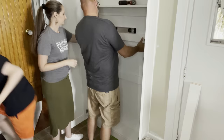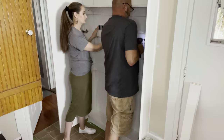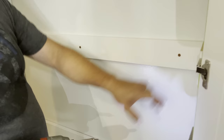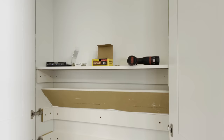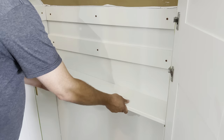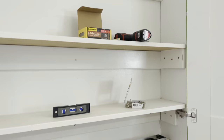What I love about this project the most is that we were able to install shelves where we wanted them and however many we wanted. I had already purchased a few things for this cabinet, so I used them as a guide to make sure my shelves were perfectly aligned with the items going inside. A tip here: I would highly recommend installing your shelves from bottom to top. Our brad nailer had trouble getting into smaller tight spaces, but if you install bottom to top you won't run into that problem. We used Total Tech all along the way as we installed all of these shelves.